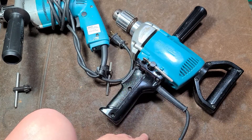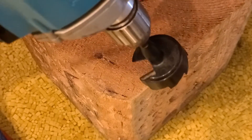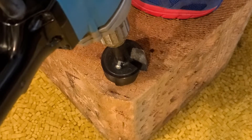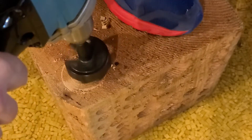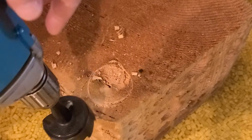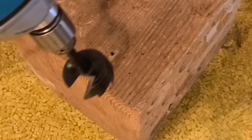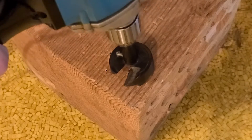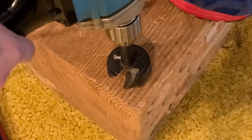Let's give this a quick test. We're going to see how this does — you'll hear that another difference over that pistol grip drill is just much more airflow in order to sustain higher continuous heat output. Let's give this a shot into some end-grain — a 2-9/16 self-feed bit in the end-grain fir. We'll just do a little test here, see how it feels. Whoa, that is pretty torquey. And yes, end-grain is tougher. Might be safer at even a lower speed. Anyway, for that inadvertent demonstration, I should have known better. This scrap block of wood is pretty dry. You really need sharp bits and especially good bracing when you're going in the end-grain, because you're just trying to cut across all the layers of that plant cellulose, versus something like a face where you're kind of shaving and splitting it up — it can be orders of magnitude the difference in amount of force.